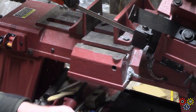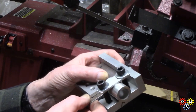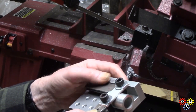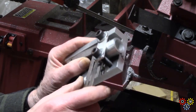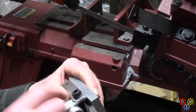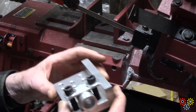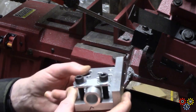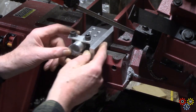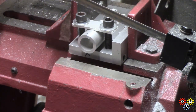All right, so this is all down and dirty really. I've got a very basic clamping setup, and this piece of tube was faced off in the lathe so I know it's square at the back. I've set it up square, done that up, and we'll see if it'll take a cut. I've marked it up — as I say, it's very approximate. Let me just get this set up right; let's see how it goes.